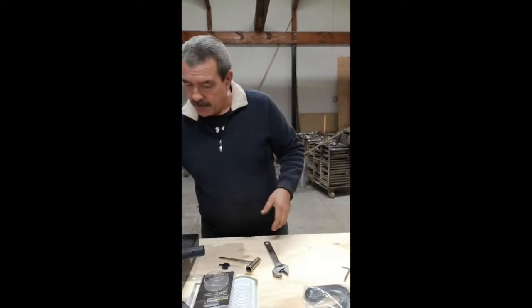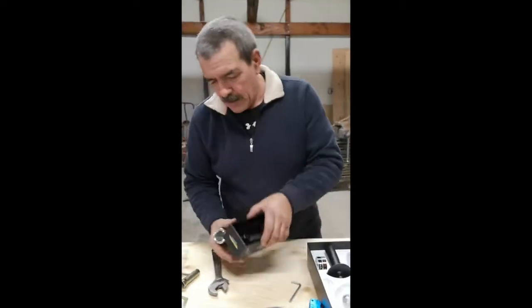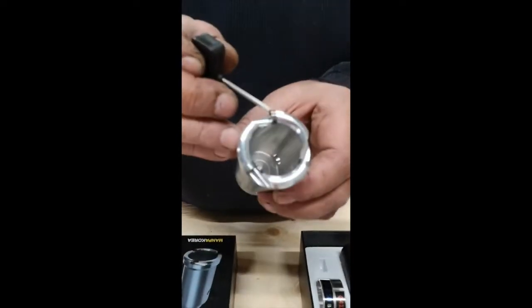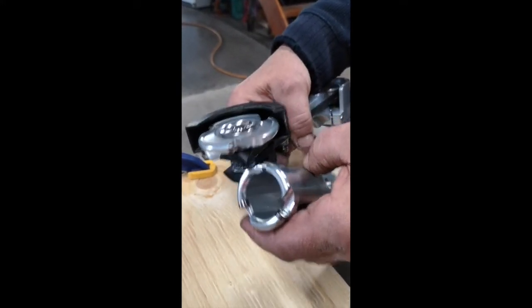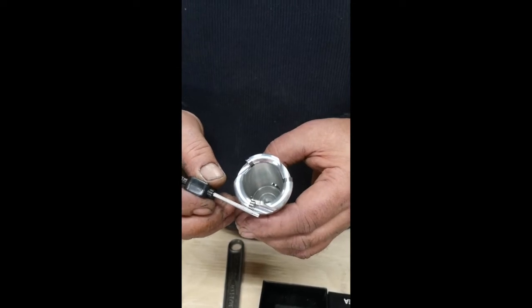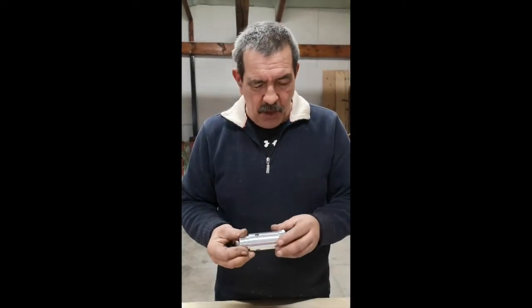The other tools that Manpa Tools — Jack for Kyong Min — sent me was the hole cutter. This one here is two inches in diameter. If you come in close you can see the round carbide cutters, very much the same design as the others. There are three cutters again, and the geometry — the height of this edge versus the height of this edge — determines how much each cutter chips off every time it cuts. It chips off that much and then releases, so this can be a very smooth tool to work with.